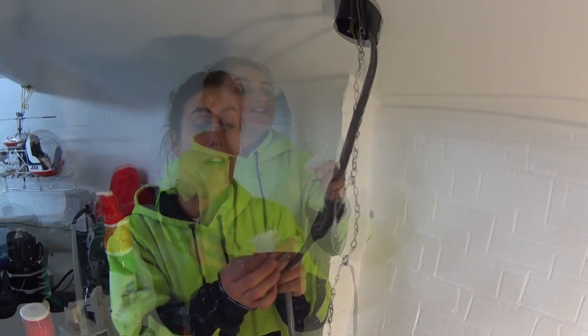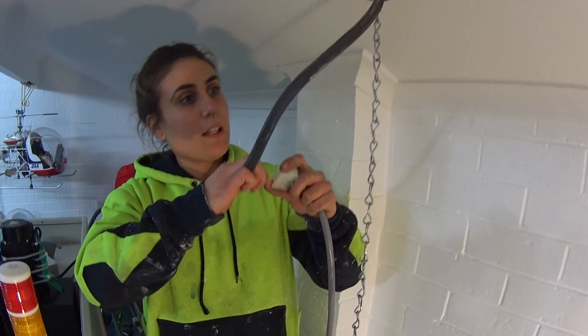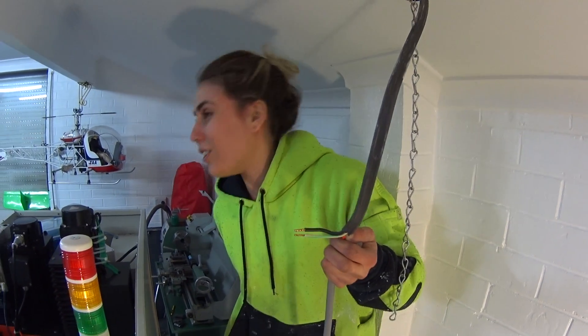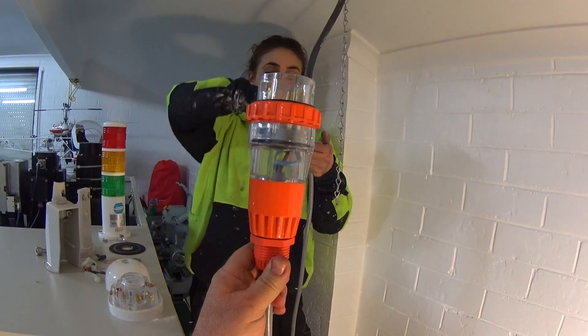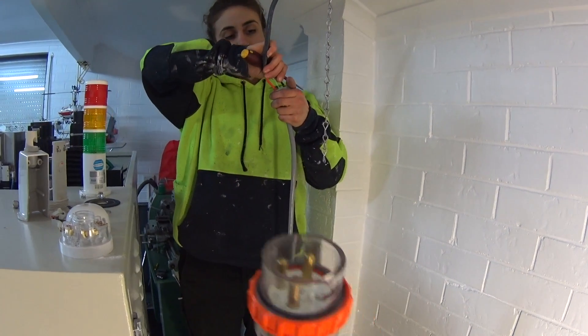So what are you doing here, Jacinda? Wiring power. You'll be able to connect your plug into a hanging pendant — because who doesn't like industrial connections? What size cable are you running? 4 mil. 32 amps. So the circuits will be capable of running 32 amps, that's why Jacinda's running the 4 mil cable. She's got me an industrial size plug, which is really good to flow that sort of current.